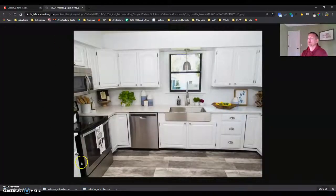In an elevation view, here's the stove or range again, the micro hood, and an upper cabinet above it. A few things to know: dishwashers are 24 inches wide — same as putting a 24-inch cabinet in that space. The range is 30 inches wide.